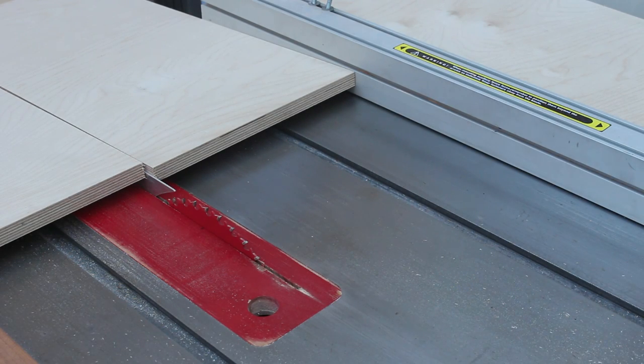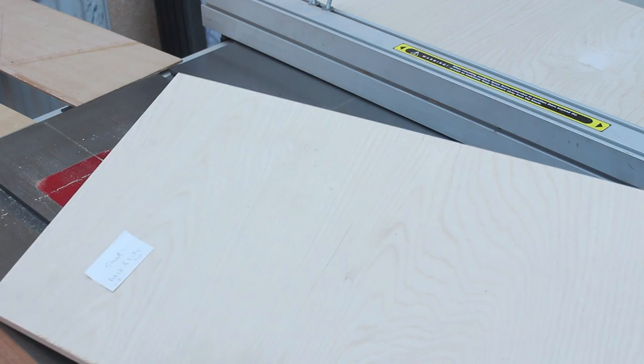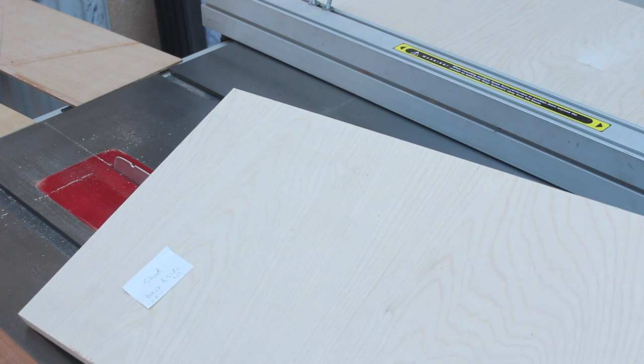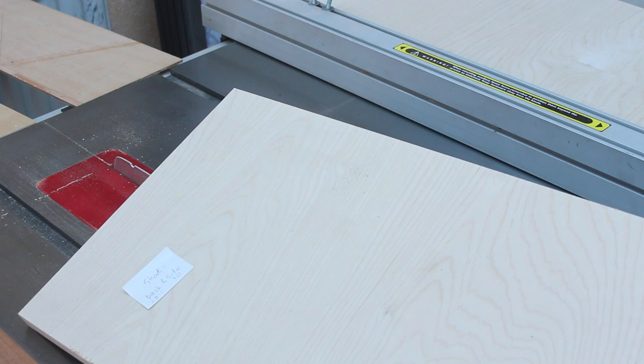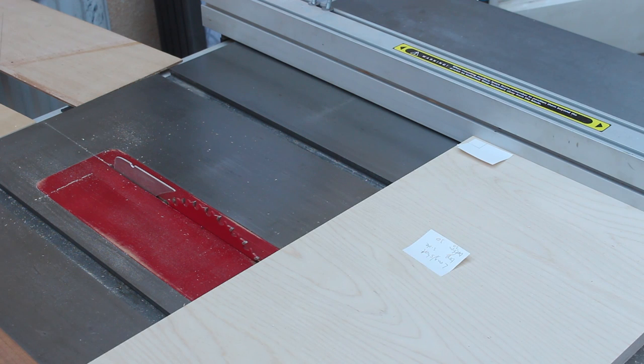Those are the three that need to be cut to a width of 30cm. The last piece is shorter by two rebates. I'm not going to cut the 28.1cm back panel now — I want to get the final size once everything is assembled and the rebates are cut. The top and bottom are square, so rather than move the rip fence, I'm going to run them against the rip fence as-is — it's a much smaller piece of wood.